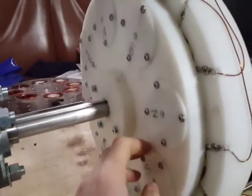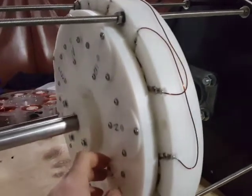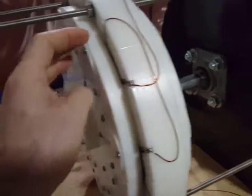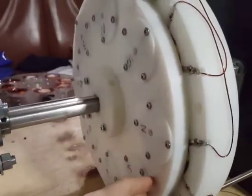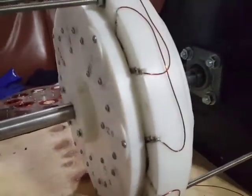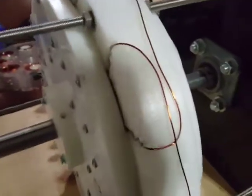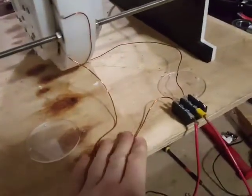The way they have it wired is eight coils, and this one has 16 neodymium magnets — eight magnets on each disk. It's north-south, north-south, and so on. They are connected in series and here are the output terminals.